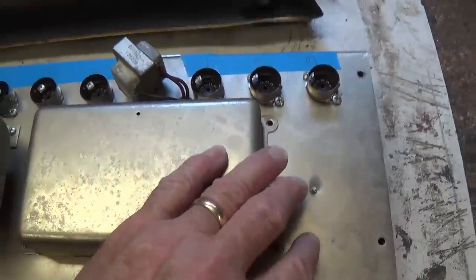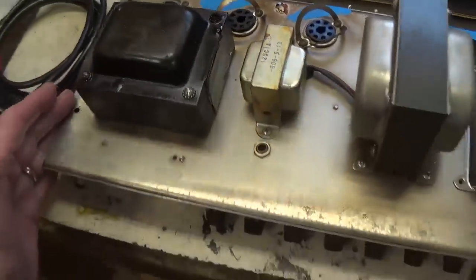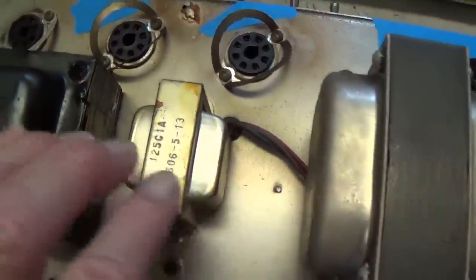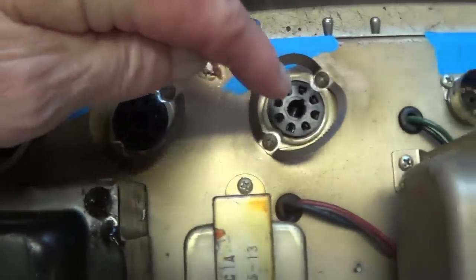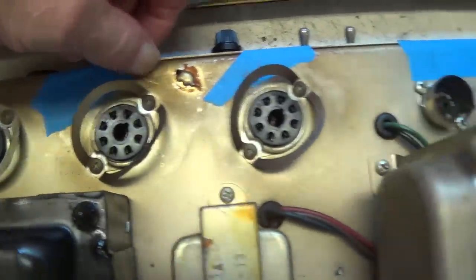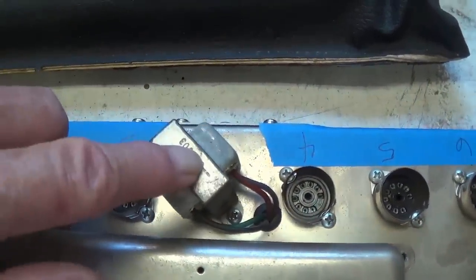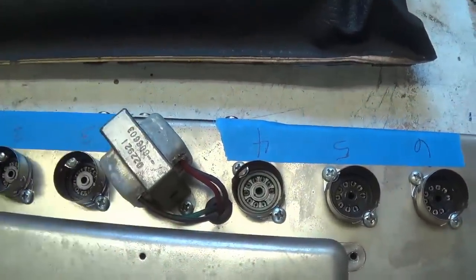We'll be looking at the lower side of the amp here at first. Then I'll put it in the chassis stand that I have so that we can see the control panels front and back a little better. When we go down the line and check that all transformers are original, you can see that a lot of heat has been produced by these 6L6 output tubes, and it's reflected in the darkening of the chassis surface. This is the driver. It amounts to an output transformer that drives the reverb tank just like a regular output transformer will drive a speaker. We'll talk more about that later.